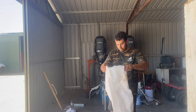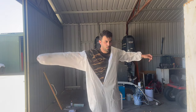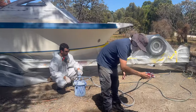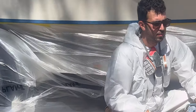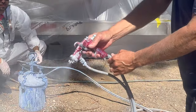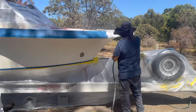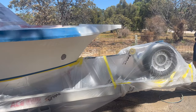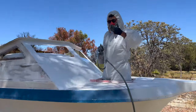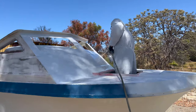For the Pacemaker we are using the four-to-one mixed epoxy industrial primer. Just as we're about to start spraying, the pressure pot decides it doesn't want to play ball. As you can see from the video, very frustrating — I think the needle was getting stuck and it was just spraying out fluids, it turned into an utter mess. So we ditched that idea. We had the epoxy already mixed and ready to go, so we decided to grab the automotive spray gun, thin it down, and start spraying.